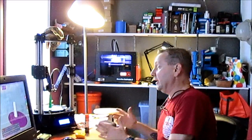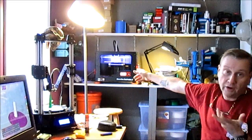I think that's about it. That's all I've got. Oh no, I'm sorry, let me take it back. Next week I have a CreateBot DH02 delivered to work. Now that is a dual-head system, ABS, PLA, PVA, HIPS, with a heated bed that's 250 by 250 by 450. So it's basically a 9.8 by 9.8 by 17.7 inch printer that prints in a vertical format, but it's a square or Cartesian bot.